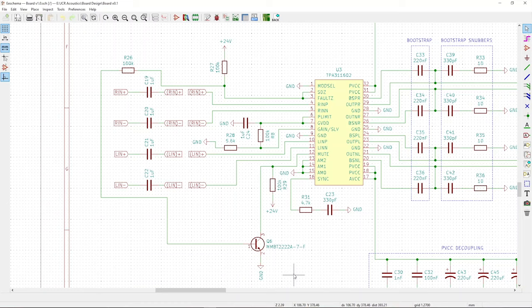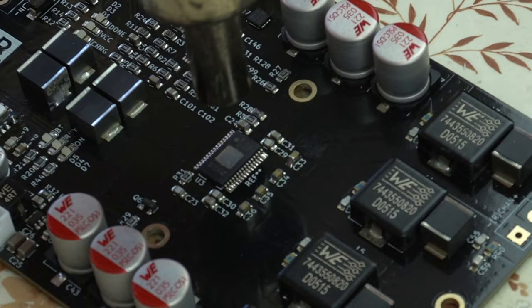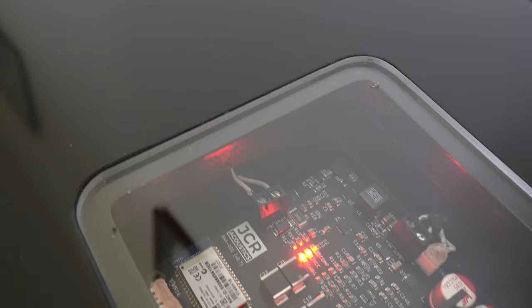The input stage is much simpler — it consists purely of running in the audio channels from the Bluetooth receiver and setting the gain, which determines how hard you drive the audio signal into the amp. Higher gain is louder but generally means more distortion, so it's a design trade-off. Since it's just two resistor values, you can easily change this after building your amp and experiment. I started off low but found it too quiet and could actually push it to the limit shown in the datasheet with little to no audio distortion.